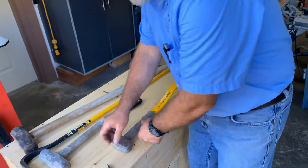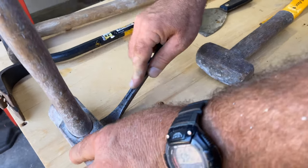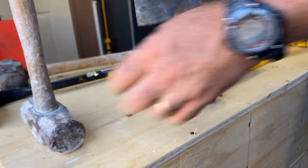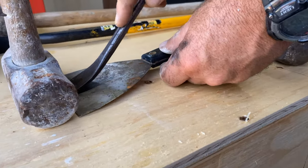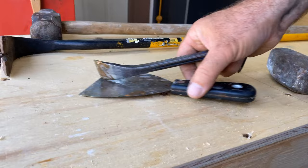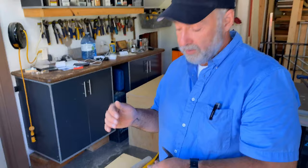There's one little trick I want to show you. Let's say you want to pry something — say a cabinet — and it's against a surface you want to protect. You could just go in there and start prying, but you'd be prying against the surface you want to preserve. A better option is to use a drywall knife — a 4-inch. Anything with some sheet metal to it, you can put it underneath, and now you can pry against it, protecting your surface. You can slip one of these in at an angle or straight on. It helps quite a bit when you have to do some careful, finesseful tearing down with minimal collateral damage.